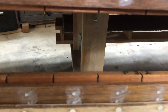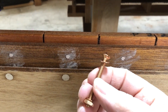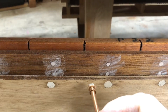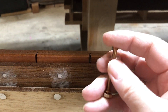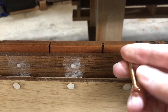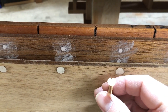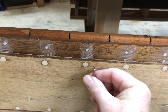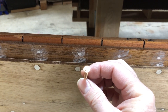So what I'm going to do instead is use these 10 by 32 machine screws, also silicon bronze. These will go all the way through the plank, the original backer board, and the additional backer board. On the inside it'll have a washer, a lock washer, and a nut. That'll hold it secure, and I'll countersink these just enough to get a mahogany plug on top of them, keeping them a little bit shallow. I could add a couple additional if I decide to, but I think that's a really good fix for this problem.